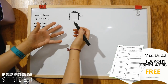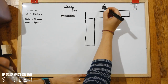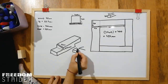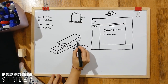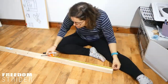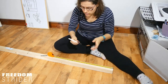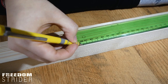So now we need a hole of 400 by 400 millimeters. To do that, we can't cut the wood 400 by 400 because the wood has a thickness. We have a plank of 47 by 47 millimeters, and because we're going to be using a lap joint, each of these planks needs to be 494 millimeters long. We need four planks of 494 millimeters. To do the initial cuts we're going to use our mitre saw, which cuts about 2 millimeters thick, so we need to allow for that in our measurements.